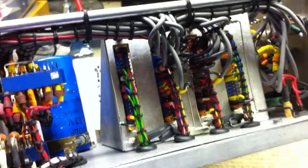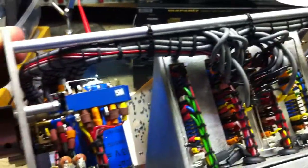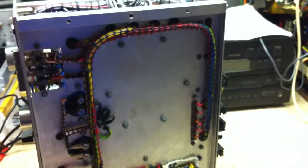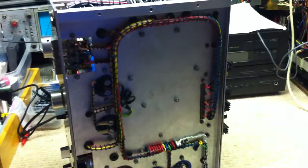But there's a bit of a mess, so I think somebody's got to it unfortunately, because even without the power amp boards in, you get some drive to the headphones. Whichever board you have in, you always get both channels — so like a mono configuration — which obviously isn't right.